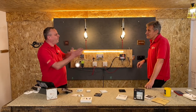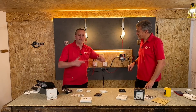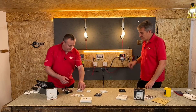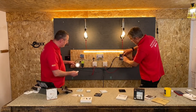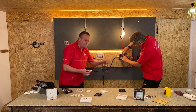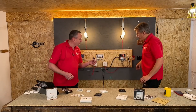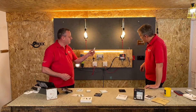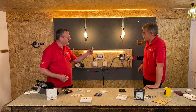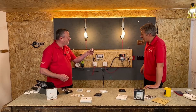What if I also wanted to control this outdoor light from the same switch as your downlight? So you pair this one to it as well - currently I'm okay with this one, so exactly the same process. Press it three times - that's in pairing mode. Now pair the switch. Did the light change on that? It did. So if I press it again, the downlight's gone on as well.